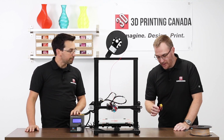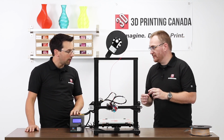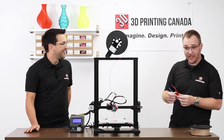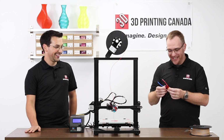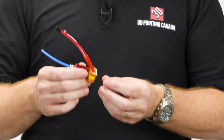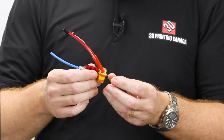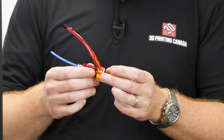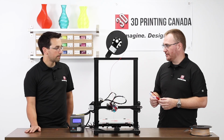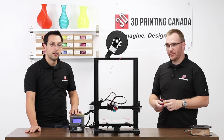I think you made a video on how to change a nozzle on the CR-10, right? Probably at some point, or you may find it on my channel, but it will be in French. So that's the same way. If you want to unclog your heat break, you have to remove the old assembly: the nozzle, the heat block, and the heat break. So it's a little bit of work, but when it's clogged, there's no other way to do it.